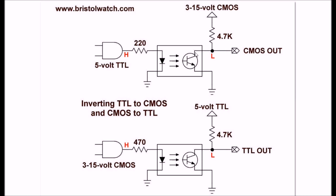So it inverts: high in, low out. You can use essentially the same circuit again — this might be a CMOS circuit on the input, and again it's still sourcing the current; it provides the current for the LED, this time through a 470 ohm resistor. You'll have to increase the resistor if you're running the CMOS at 15 volts. A high in turns on the LED, turns on the output transistor, and the output — because it's connected on the ground side of the load — goes low. So the logic level is again inverted, but you're going from say 15 volt CMOS logic to a 5 volt TTL output. This is source-in, sink-out, inverting.